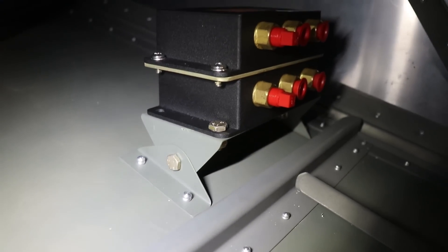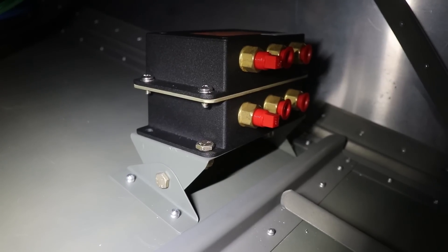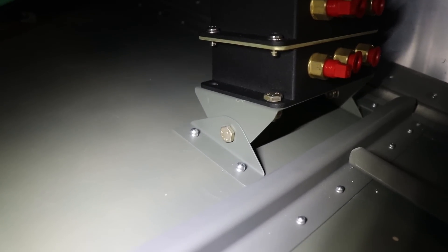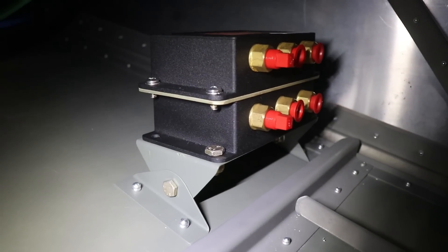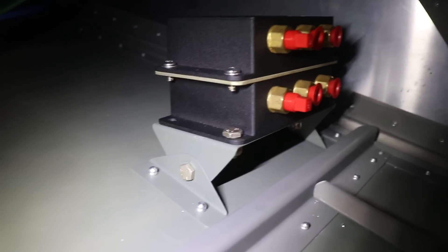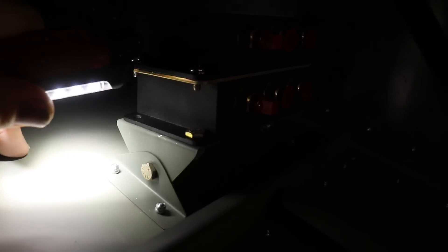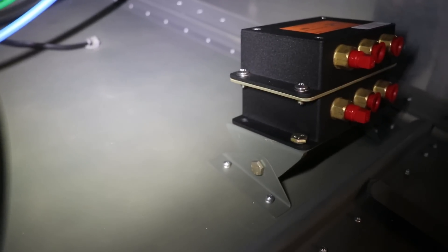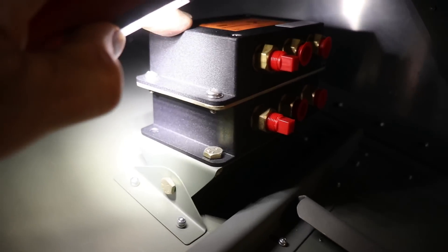I'm inside the airplane right behind the access hatch — you can see where I have it mounted and how the rotation works. I can level it once I level the airplane, or make adjustments after it's flying. One thing I noticed in my cruiser: the attitude indicator was moving slightly because the skin vibrates when flying. To fix this I took one of these angles, put double-sided tape on it, and ran it front to back to stiffen the floor. You could rivet it but double-sided tape works just as well since it's not structural.